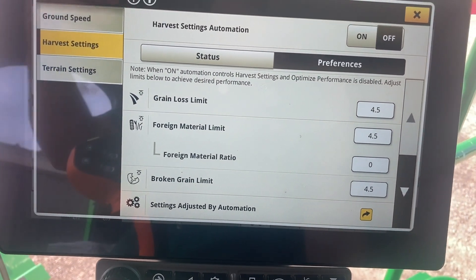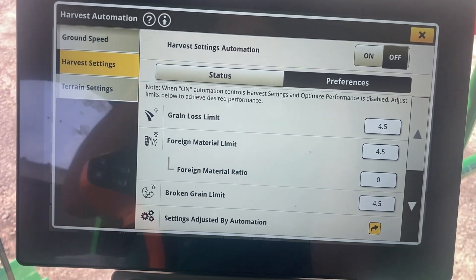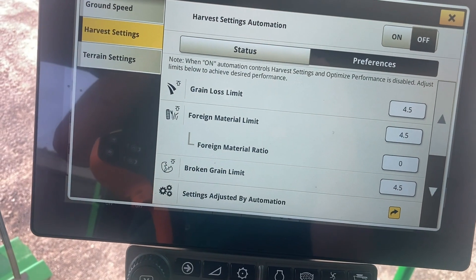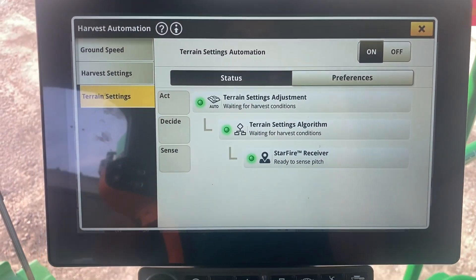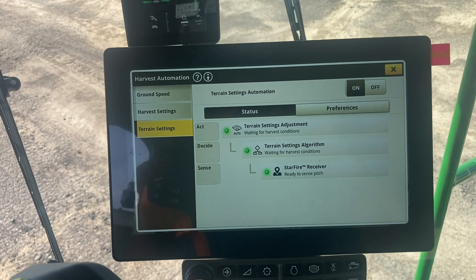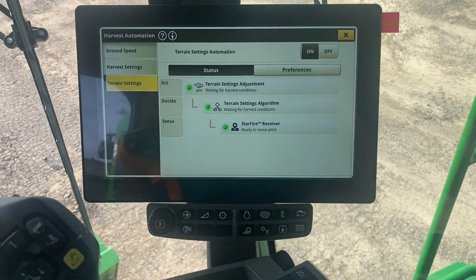The other things we can pay attention to: what kind of crop preferences are we looking for? This machine is only going to be as smart as we tell it to be, so we have to tell it what we're going to be okay with on the scale. When we turn it on, it's going to learn those parameters and try to achieve the limits you're searching for. Last piece: terrain settings automation. When you're going up or down a hill, this combine is going to adjust — changing parameters to try and keep grain in as you're going up. Going up an incline, gravity takes over, so we slow things down to let gravity do some of the work. Coming down the hill, we speed the fan and other parameters up to try and beat gravity. Pretty smart little system.